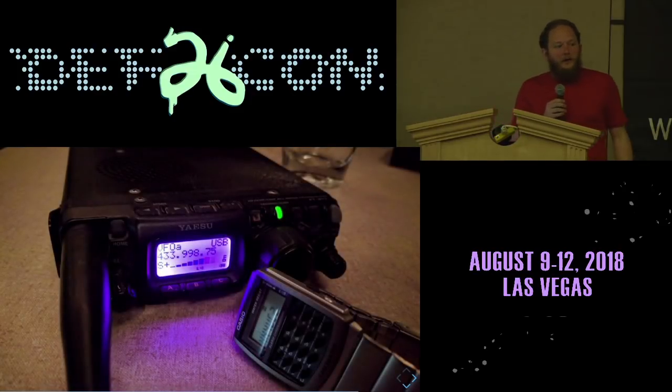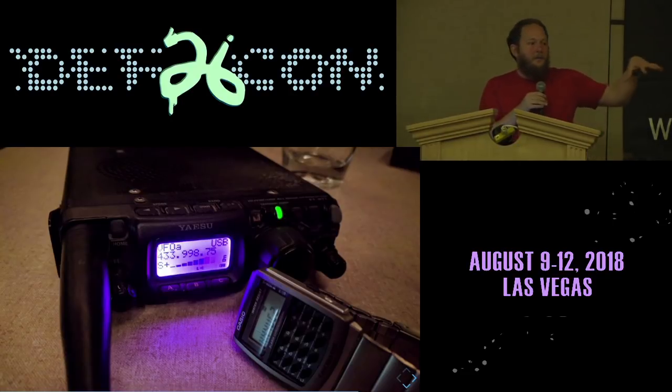Transmitting is a lot easier because it's only using energy for the time that you pushed on the button. So we have a Morse code mode where you can push the side of the watch as a Morse code key and then send that to any single sideband receiver within range. So here we have a Yaesu 817, and we had this set up at a bar, and then my buddy took the watch 4 blocks from the bar and was saying hello in Morse code, and we accurately received it.